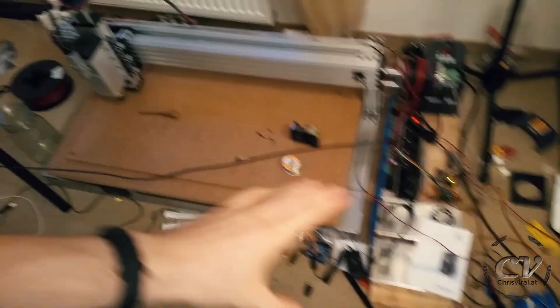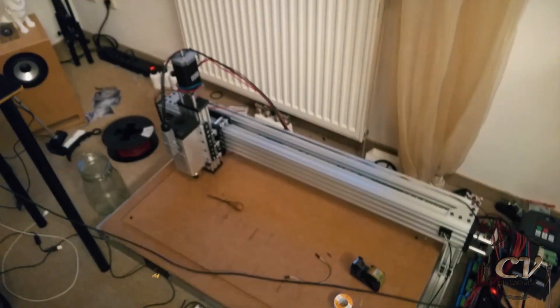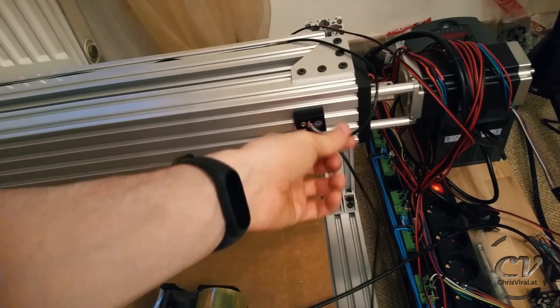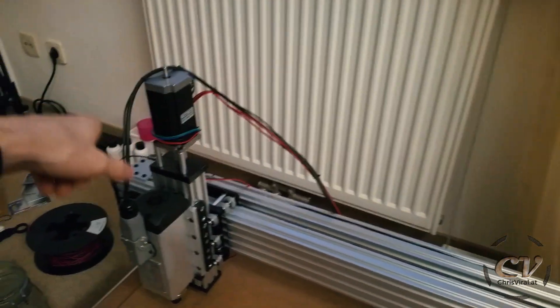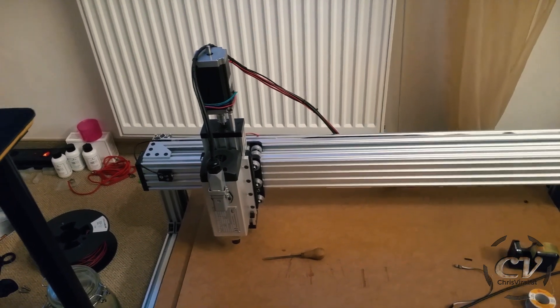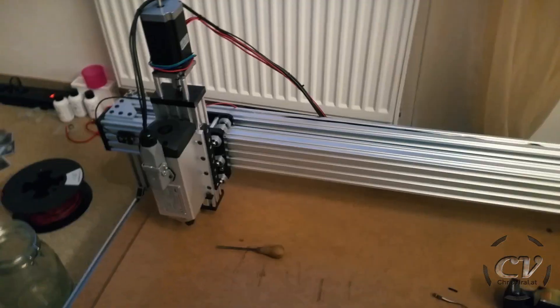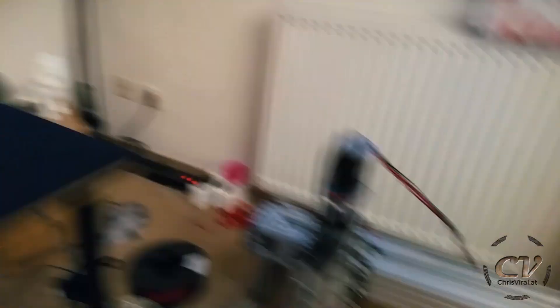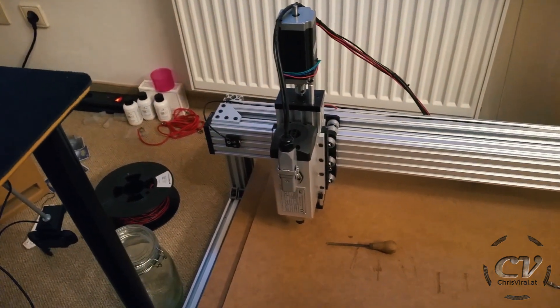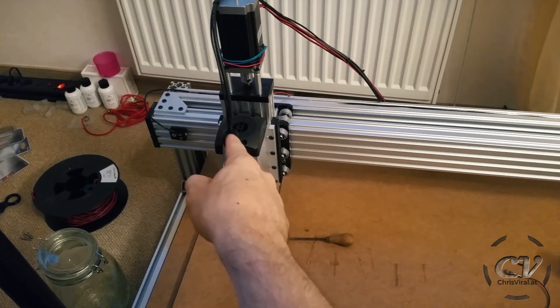The solution is probably to exchange all the cables with shielded cables, especially the ones for the switches — that's the topic for today. It's a bit messy but I cleaned the surface and already exchanged the first wires for the X-axis switches with a shielded cable. The lead is super thin so I won't be able to exchange the ones for the spindle and steppers, but for now these are shielded. And now I can actually use all steppers without triggering any of the switches — but if I do trigger them, it does alarm. Let's do a first real-life test and actually hit this switch with the spindle.